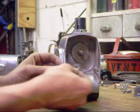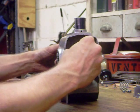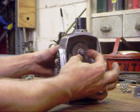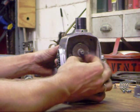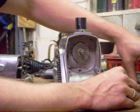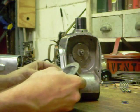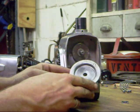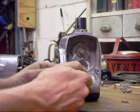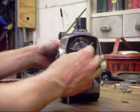There are two washers that go to either side of the fan — we're going to put this one on first. Make sure to push everything all the way back. The spacer stands a little proud of this housing, so the washer will not be rubbing against it. We install our fan, which has actually been drilled for balancing from the factory — that's the dust fan. That's pretty impressive.